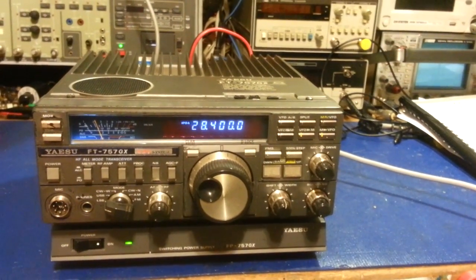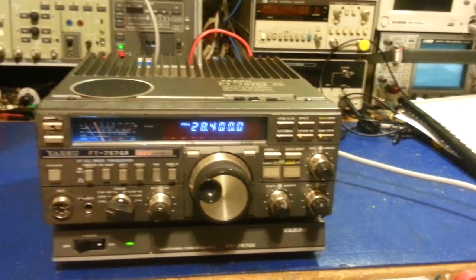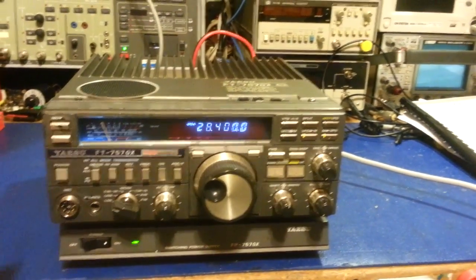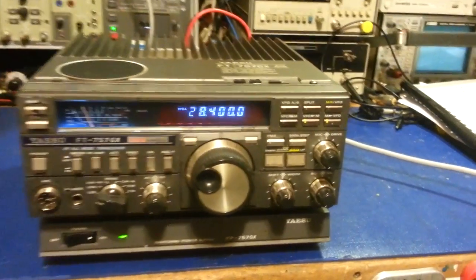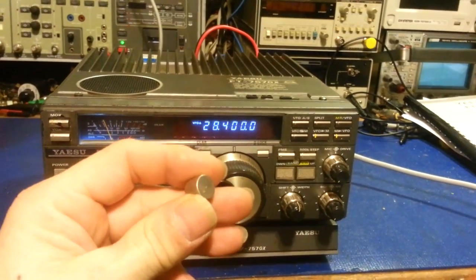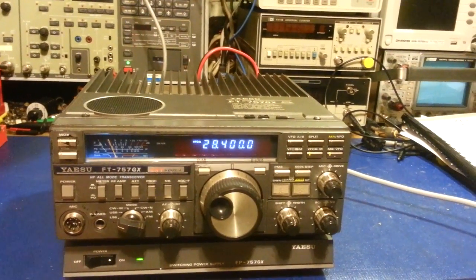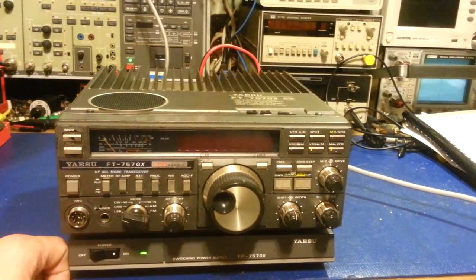Like I say, don't need to make it complicated. The battery is safely tucked away in there where it's at, and don't have to worry about it bouncing around, wires rubbing or anything. Now I always use Teflon wire insulation, a little bit better, but you don't have to. Like I say, just standard hookup wire. Just make sure you put heat shrink tubing over the 2 terminals that are sticking up, where you pop them off of the original battery, and then put a piece of heat shrink tubing over top of the battery and slide it in behind the RF shield there, and you'll be good to go. And you can have memory again too. So I hope this helps somebody out and saves you a little bit of time.